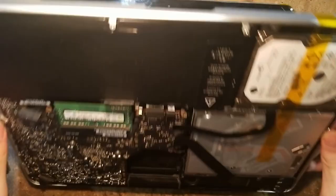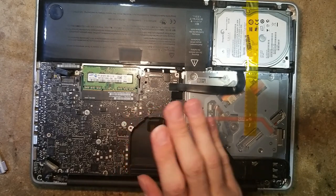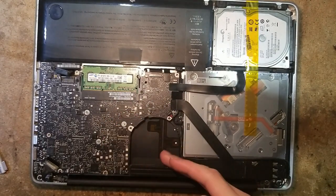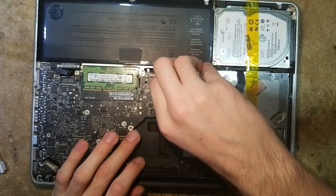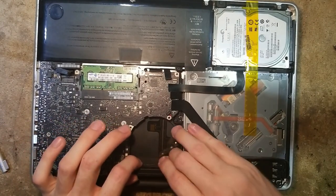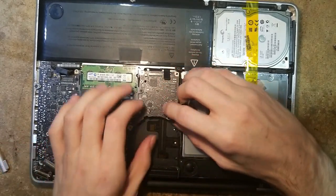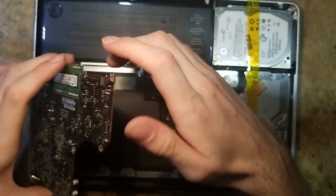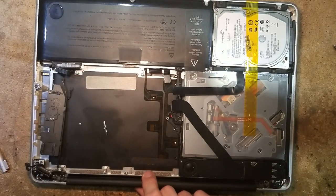We know that it's a logic board issue, not a Wi-Fi card issue. So here is the logic board, here is the Wi-Fi card. Since we tried another working board in this chassis, and Wi-Fi is working fine. I only plugged in the Wi-Fi card, HDD, touchpad, display. And this is the board. Nothing else was needed for this quick diagnostic.